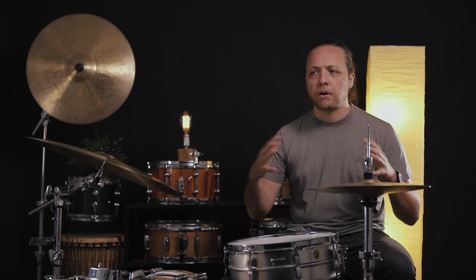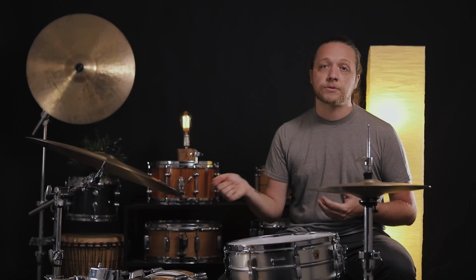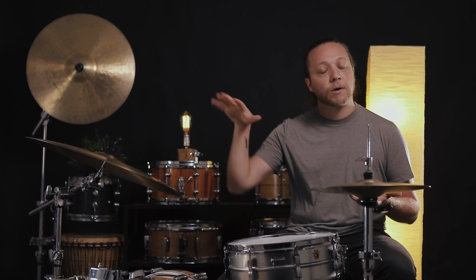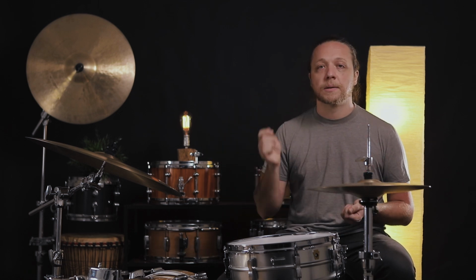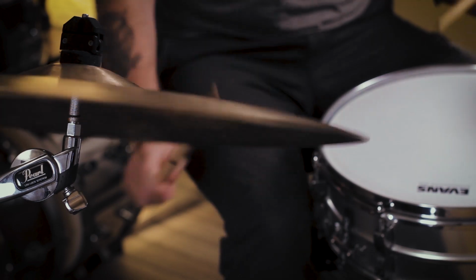It can really affect stick definition. It can really affect the overall wobbliness and feel of the cymbal. People who have talked to me about making cymbals in the past have expressed that a lot of the time, when they're working on pre-existing cymbals that the owner wants weight removed from, they'll only remove it from the bottom of the cymbal and never from the playing surface, because removing it from the playing surface will actually change how the cymbal feels, but removing it from the bottom has less of an effect on the playing experience of the top and the stick definition, and still gets the weight off.